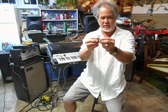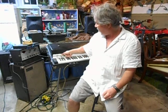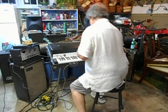And here's the tone pot, and I find that probably they're acceptable, but like everything, they're not as well made as the vintage stuff. So I had to take these out. I'm using their jack, but using this new old stock 15K pot. So there's no tone control. And damned if you don't really need it, because if you voice it correctly and accurately, then you set the tonal characteristics of the Rhodes. How much low end, how much high end, so you don't need a tone pot to be adjusting your bass. And that is the challenge, right? So I think I'm pretty good.